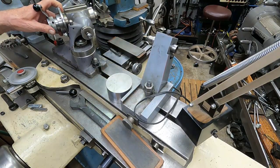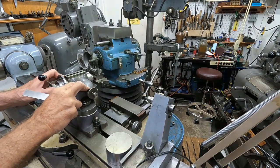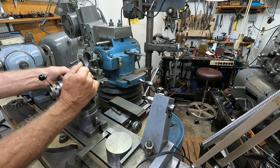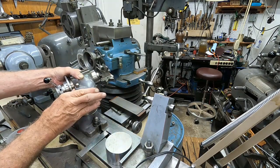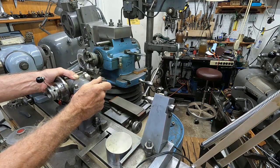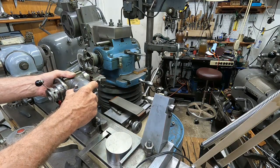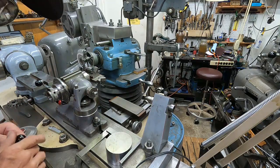Let's see if you can see me swing that over — I can swing that over like that and grind that top, changing the angles at will. I can get a little bit of back rake by moving it the degrees this way, and then the side top rake by giving it a degree or two up that way, then going across the wheel.